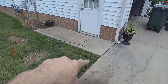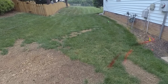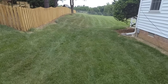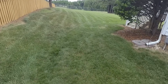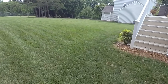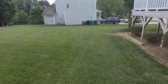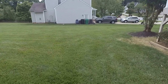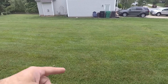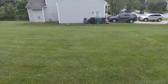He had talked to me about trying to do a pipe across here and a French drain. The problem with that: if we did anything with a pipe, there is nowhere to discharge the pipe. I basically told the homeowner I don't feel comfortable having a pipe come out somewhere right here and just — boom — aiming at the neighbors.